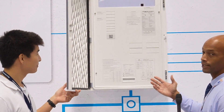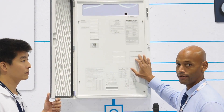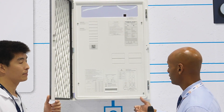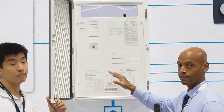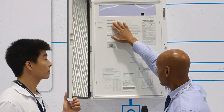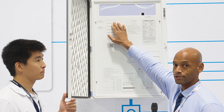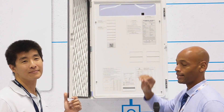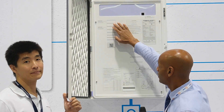Let me show you how simple the wiring plan is. You have a 200-amp dedicated generator input — that's optional, you don't have to have the generator backup, but it does integrate if you want to bring that into the mix. You have your 200-amp grid connection, which is bi-directional — you can pull in from the grid and also export to the grid if you have excess solar. And then you have up to 80 amps of AC solar output. If you have an existing Enphase system or SolarEdge system, you can take your combined PV AC output and land it here on the A-gate.